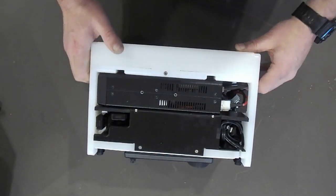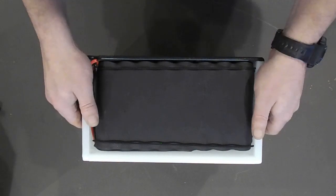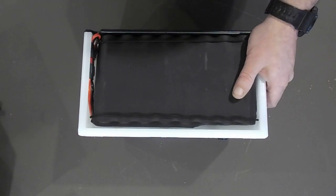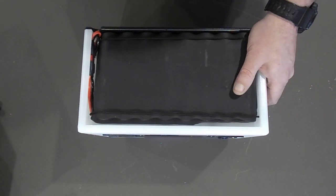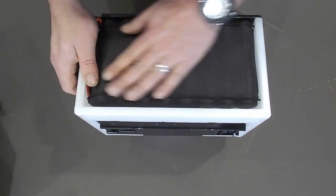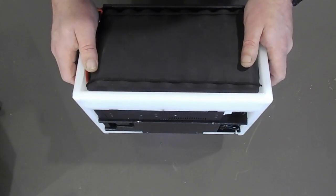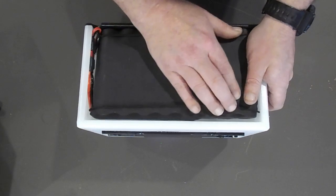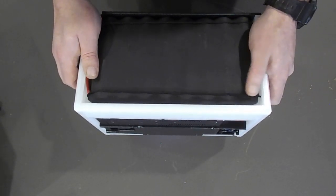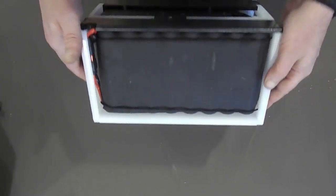One of the things that I think is really cool is this battery. We're at the point now where we're building our own LiFePO4 packs — our own cells being made for us that we've done an intense amount of testing on. So far our own batteries are averaging about 10 to 15% over spec in actual performance, using load centers designed to draw the battery down at various rates and very accurately record the actual energy stored and retrieved.